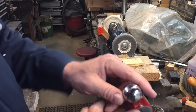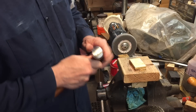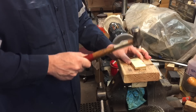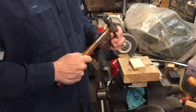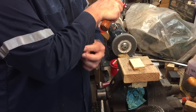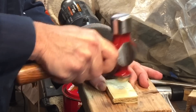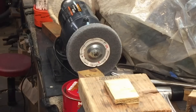Another thing: if you're going to use the ball end for peening something over, obviously you're not going to use the end of the long handle, because it's very hard to get that exact control. Remember, you have a small hammerhead you're trying to get accurately onto the work. By using this short-handled version, you can really get close up here. If you choke up on it, you don't have the handle banging into your arm, and you can really get in there — once you try it, you'll never go back.